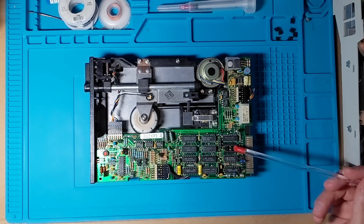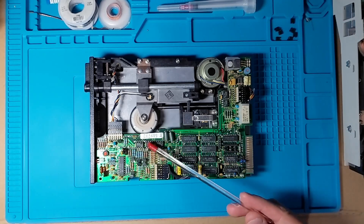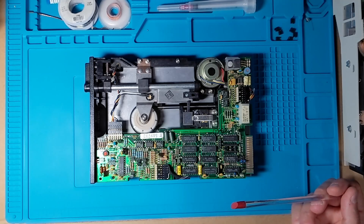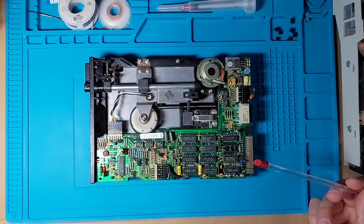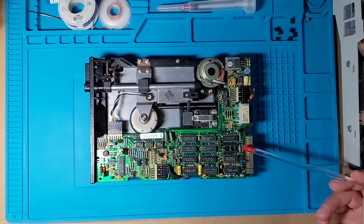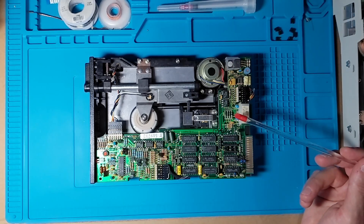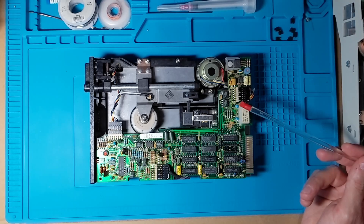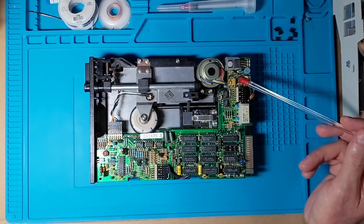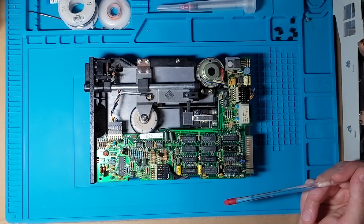Some of the main components I'll talk about: the Q13 transistor, the main Q14 transistor that drives the motor itself, and Q7 and Q8 transistors used on the side-select logic. The resistor network is unpopulated, and there's also the U4 chip which has the AND gates for picking which side of the disk is currently active. The drive speed control circuitry is all in this area, and this chip right here is the main frequency-to-voltage converter that drives the drive speed itself.